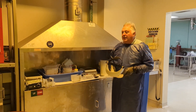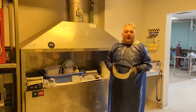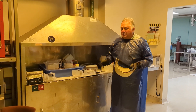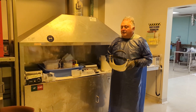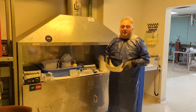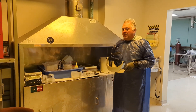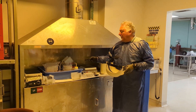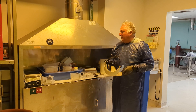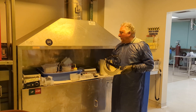What we've done already is measure the oxide thickness on a dummy wafer. Today it was about 3,200 angstroms. We measured the etch rate, and it took about five minutes. If you let your buffered oxide etch sit around too long, it'll change — the buffering agent will even stop working on you. So it's always best to use fresh. Using a little bit for one etching session is a lot better than having a big bucket and reusing it over and over again.